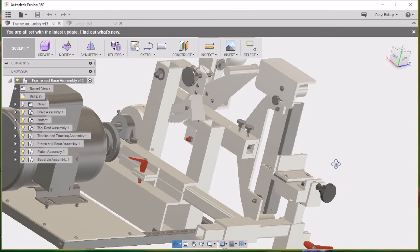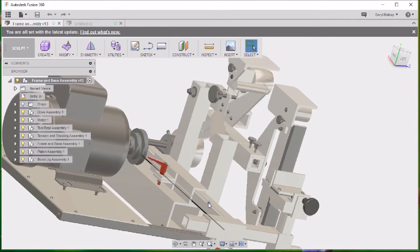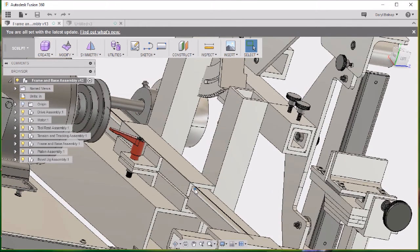What I was experiencing before, because I had used steel pipe, a 2-inch steel pipe with about a 3/16 wall, was that when you put a 1.5 in there, it would flop around by about 1/8 of an inch. Also, when you get pipe like that, it's not square. It looks kind of square, it's square enough, but it's not precision square like this aluminum extrusion is. So you really have to watch when you're putting it together.